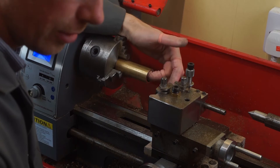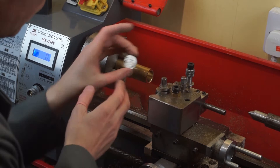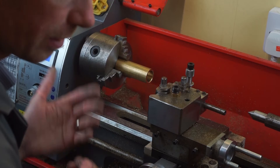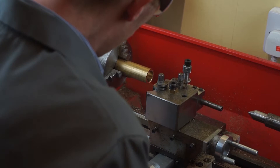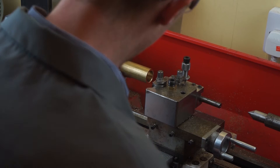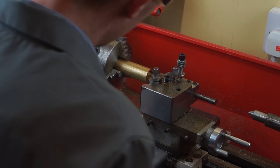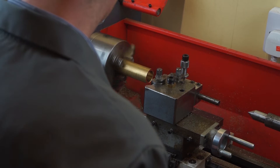The way that I actually measure the inside diameter here is I physically get a spare movement main plate and I put the main plate in to check my diameter, because that is how I know that it's going to be an accurate size. You could do it using calipers or by measuring it, but I find that if you're making these as a one-off for one watch — because one of the things we're doing is making watches individually — it's often a lot easier to just use the main plate. The main plate is 26.5mm diameter, so I'm going to take some material off.